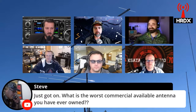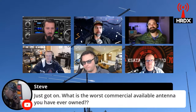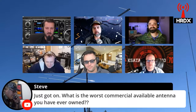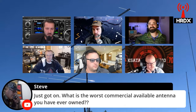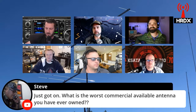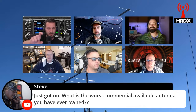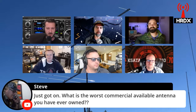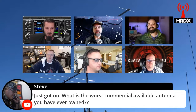I have seen sometimes CB antennas for 27 megahertz advertised as mobile antennas, and they'll advertise them as 5/8 wave antennas. One thing you need to be careful of is that a 5/8 antenna on 27 megahertz is about seven meters long — very, very long. When you actually look at these antennas, they're fairly short, and they do have a little bit of base loading, but I don't think they're going to fit that much wire in the base. You need to just do a bit of research and check out what antenna you're actually buying.